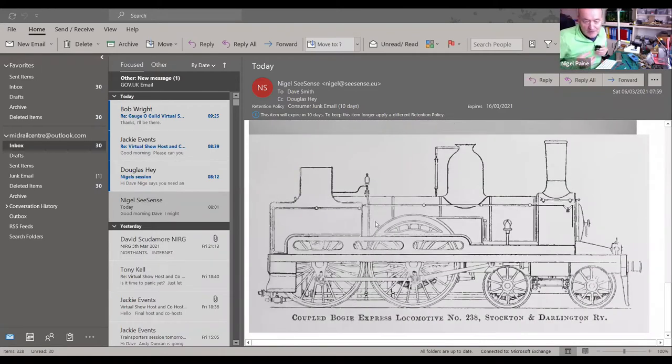So that's what Bouch designed, and it's interesting construction. The main thing about the locomotive is it had a load of innovations in it. To the back of the locomotive, just behind the steps, on the inside of the frames was a water tank, which was used as part of the transfer of the water from the tender into the locomotive. Just in front of the front driving wheel in between the frames were two mechanical pumps, which drove off the valve gear and pumped the water into the boiler as and when required.